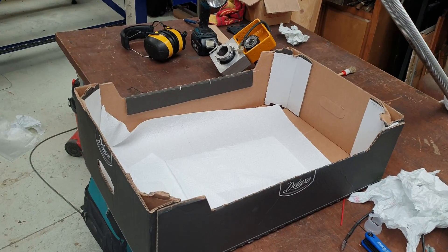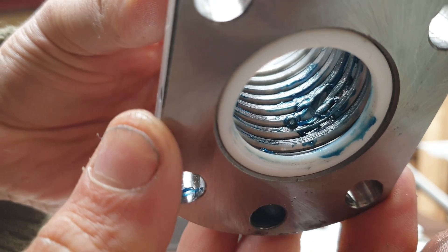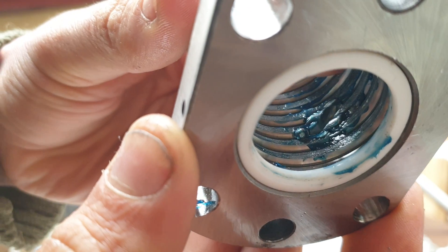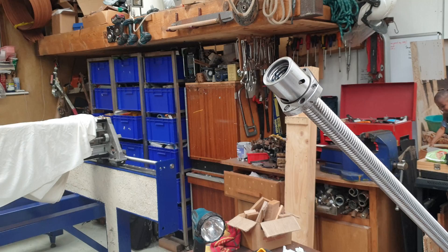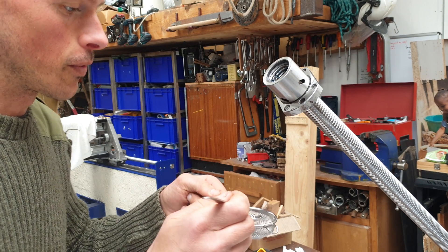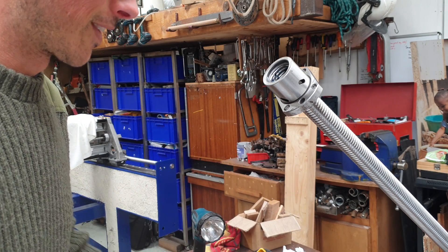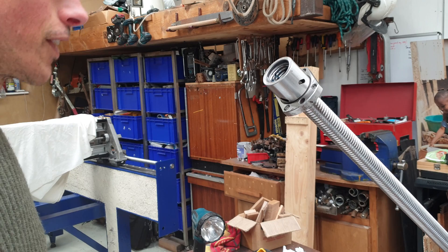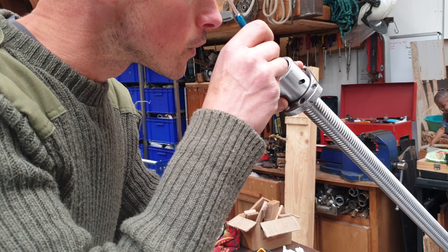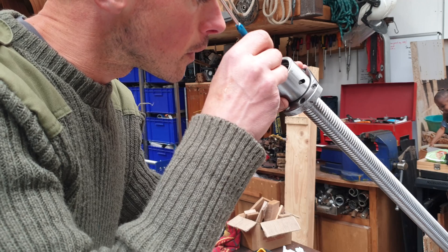Here's the setup. Use some grease and the first ball is in there, just by that first diverter there. So here's the hard part. This was my first slightly flawed method — I thought by having the screw angled like this I could just almost sort of pour the balls in as I screwed the nut onto the shaft.